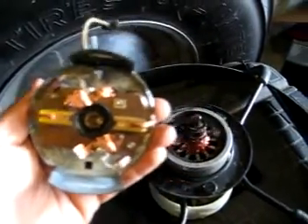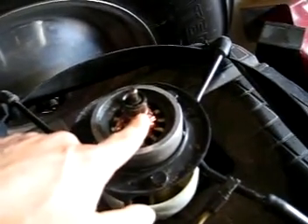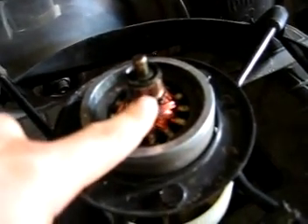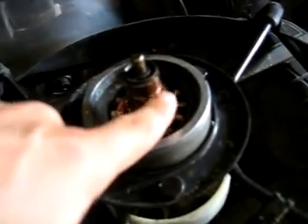The small brushes are set to make contact just after the primary brushes clear the commutator spacing. There's a coil contact here, here, and here, and as it rotates, the primary brushes will disengage completely so I don't have any cross voltage from the input over to the small brushes, so I get a pure pickup.